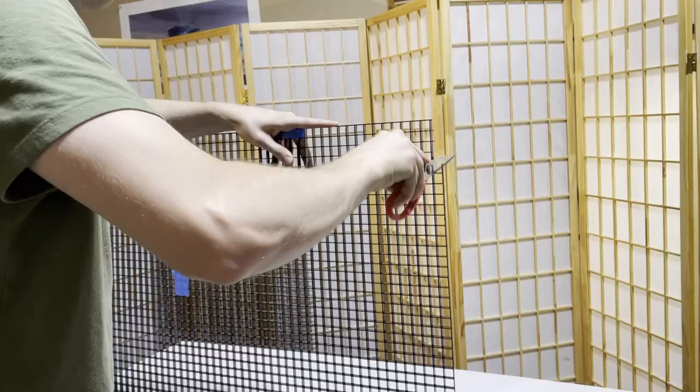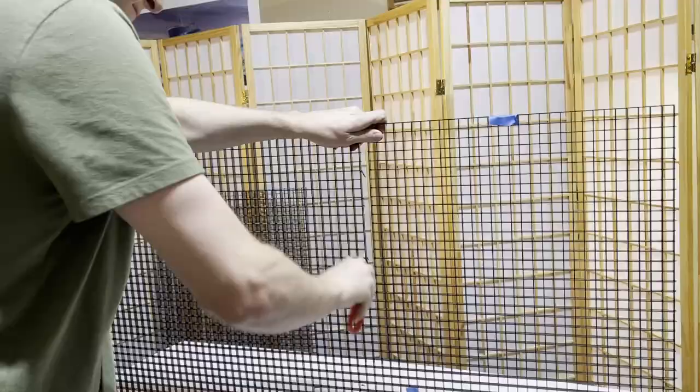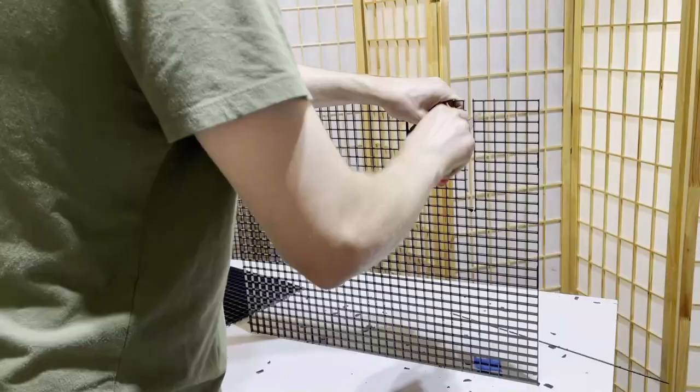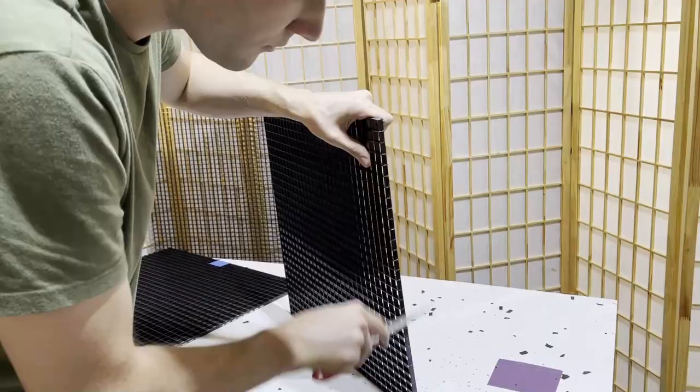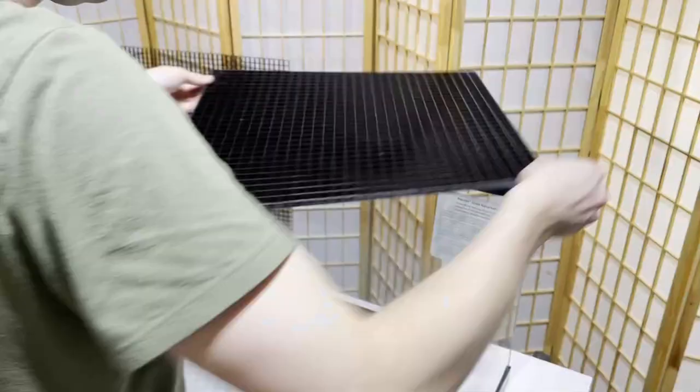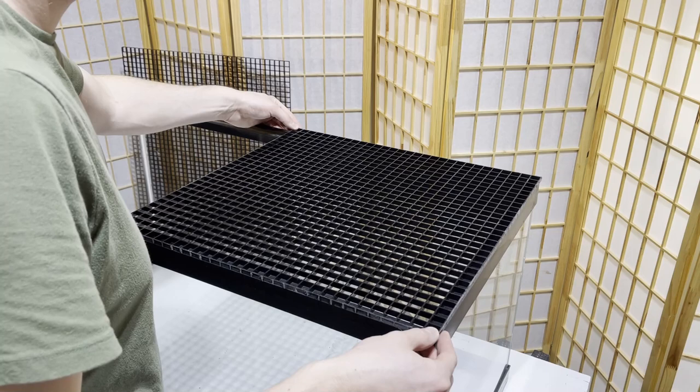You have to do everything basically in lines, otherwise it's hard to size with any sort of intricate shapes. One thing I want to point out while I'm breaking this at high speed is be careful while you're breaking these. Start slow at first because you have 2 4-foot by 2-foot sheets, and you can only make one or two big mistakes, and then you'll run out of that spare material. Once you have the ramp area to the right size, always do a fit check, especially with this part, because everything is gonna rely on this cornerstone part, you might say.